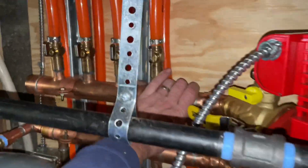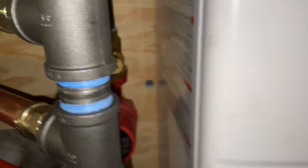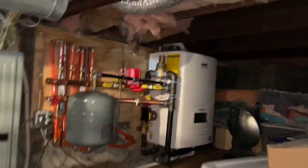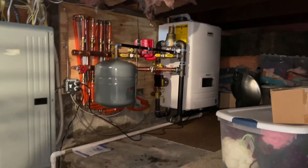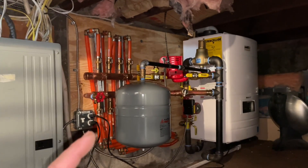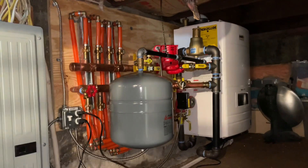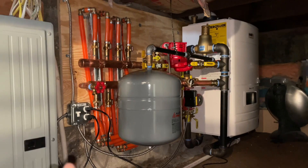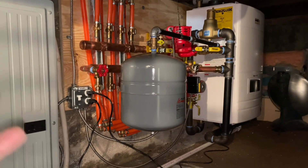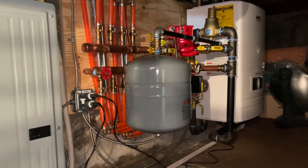We're nice and getting toasty — we're at 84 degrees. Design temperature is 90, by the way. That's the crawl space, but I got it in there. It's a closed system — I don't have any piping bringing in makeup water, and it was designed that way, to be a totally independent system. I've got glycol in the system, fresh water in there, and that's it. Low water cutoff, and if there's a problem it is what it is. We're not going to be constantly feeding water, because a lot of people's boiler feed valves are left open.